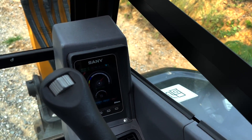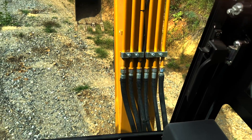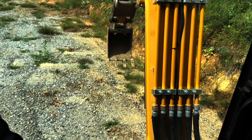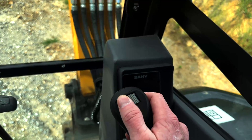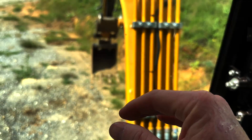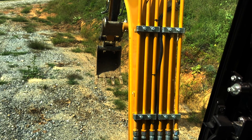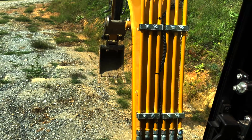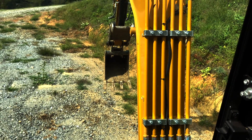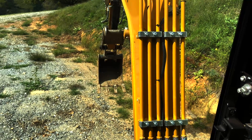In closing, that's how I have my machine set up. It's really handy to be able to set those flows — my previous John Deere 27C didn't have this. You were pretty much wide open, and it had foot control so there was no nice proportional control. I've gotten really used to this and it works really well. Especially with a tilt bucket — if you don't have the ability to control that flow, it's very difficult to operate unless you spend a lot of practice time. The problem is when you take the tilt bucket off and go back to the thumb, things go awry. I've got it set so no matter which attachment is on, there's a smooth transition to the other one. Thanks for watching, we'll see you on the next one.